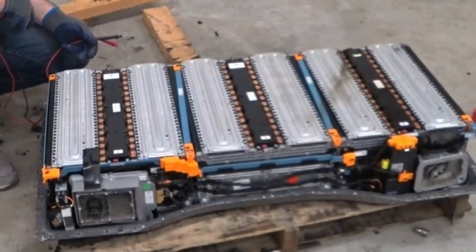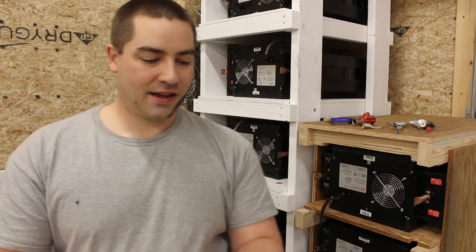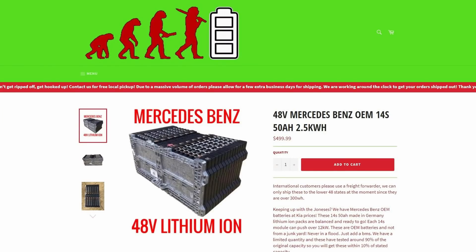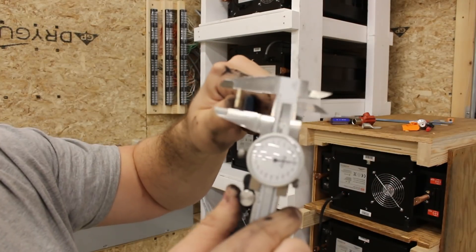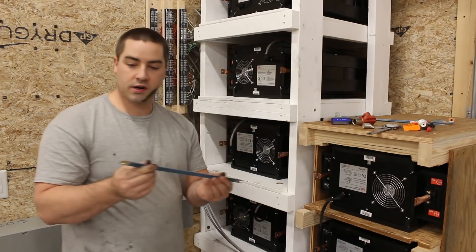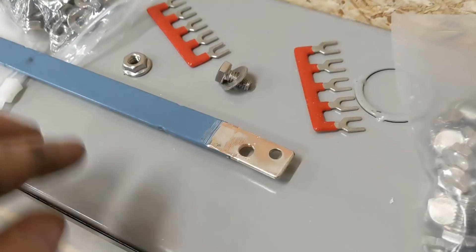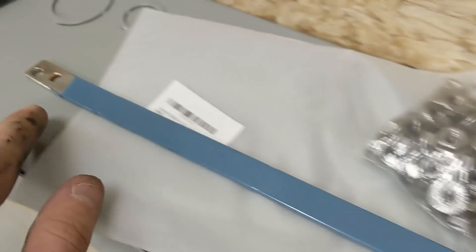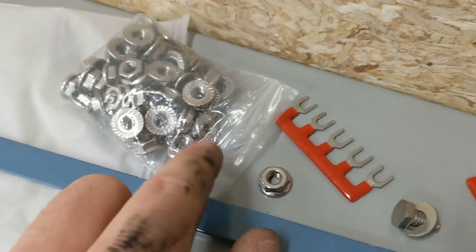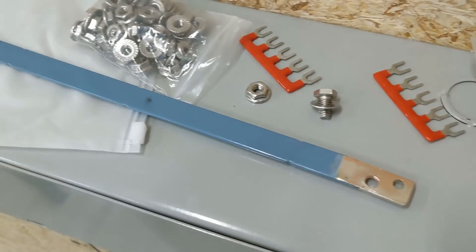These are some bus bars that came out of a Smart ForTwo electric car. I rebuilt a Smart ForTwo electric car battery in some previous videos. By the way, if anybody is interested in buying some cells for that type of battery, BatteryHookUp.com is now selling them and I'll leave an affiliate link in the description below. These bus bars are 0.595 inches wide and 0.10 inches thick. We're going to need to cut back a little bit of this paint on here, get it prepared, and drill a hole in the right spot for both sides. With the end cleaned up, I drilled a new hole on each end for the bolts to go through and beveled it. I'm going to use serrated hex nuts as well as a flat washer and a bolt — all stainless steel — and this is how I'm going to be attaching these bus bars.